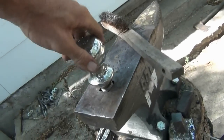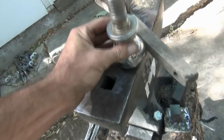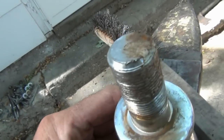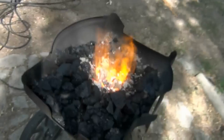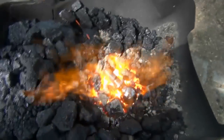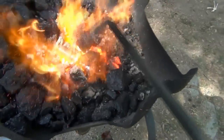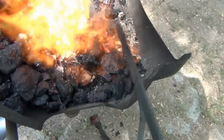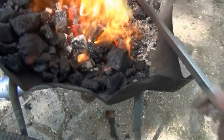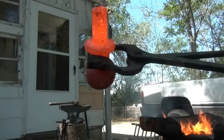I'm going to make a fitting to fit right there in my hardy hole. I'm going to heat up this big two-and-a-half incher, upset that end a bit — mushroom it, pound it square — and slam it right in there. That's premium right there. Just toss in your material, grab your extra-complex stirring stick, cover that up, and let it kick. Is that beautiful or is it just me?